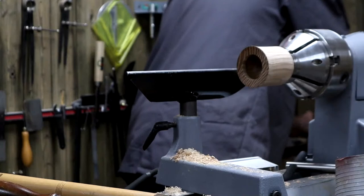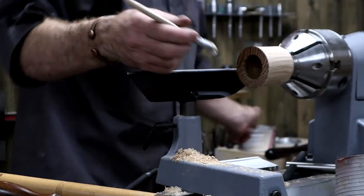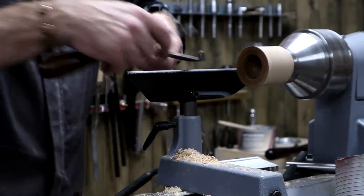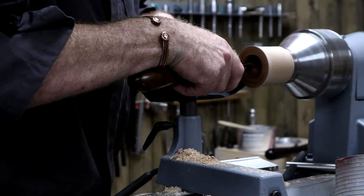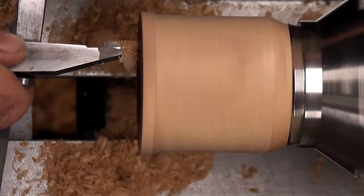I've brought the soft paste wax. A little bit on a brush - bit like a toothbrush, you can brush that in. What's that going to do? That's going to help it glide. I can go on, set my angle, set my height, make contact. Got to be moving. Nice light touches. The wax will help lubricate that thread, give us a cleaner cut.